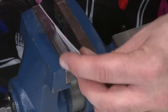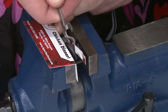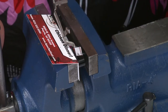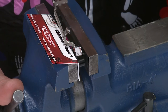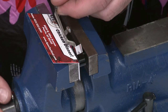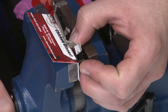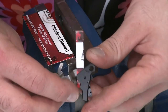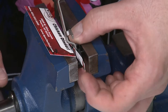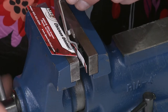Now I'll take a piece of business card folded over and use it as vise paper to prevent damage to the trigger. I'll put the smooth face of the trigger body against that paper, hold the trigger bar, and slowly close the vise jaw until the pin makes contact. Then I'll crank the vise slowly and carefully — you'll hear it kind of pop sometimes as it starts. I'll wiggle the bar to confirm, and once I can feel it capture on the pin, I know it's engaged.